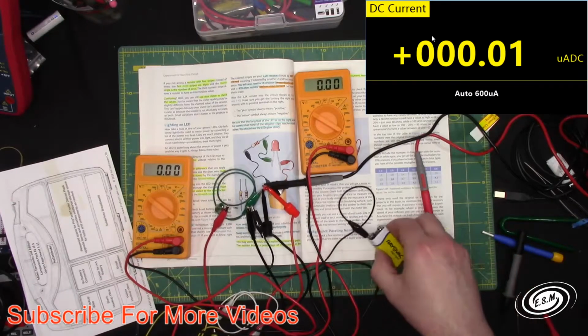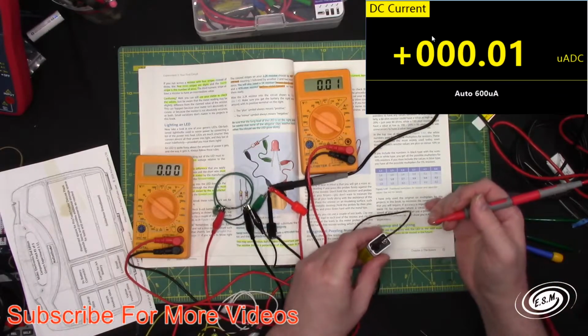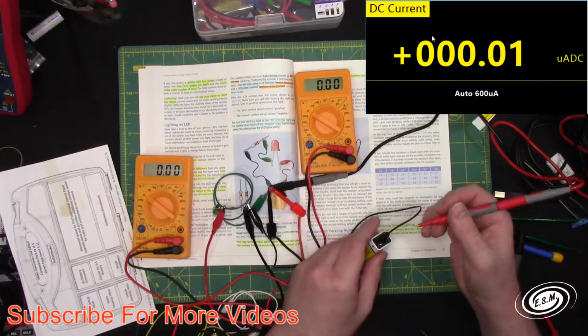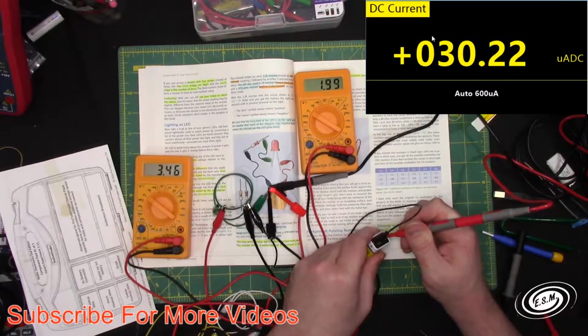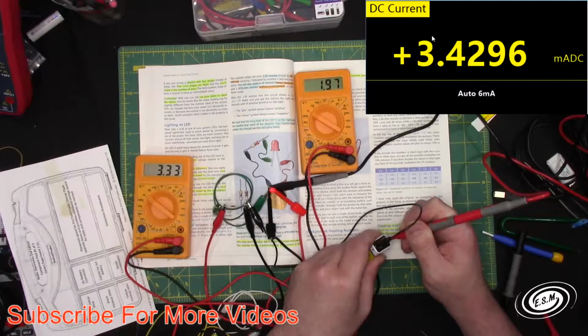And we'll check the current flowing through this circuit with the lower resistance. Now, in theory, it should be more current, and the LED should get a little bit brighter. So the LED is a little bit brighter. We're now dropping still 1.9 over the LED. We're only dropping 3 volts on the resistor, which makes even less sense. And we're drawing 3.4 milliamps, so another 1.5 more milliamps. And you can see that the LED is definitely brighter, so you can drive these with higher resistance loads.